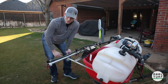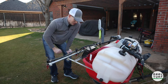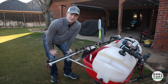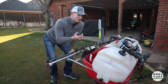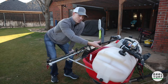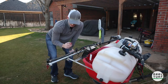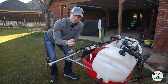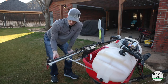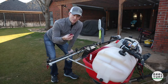These hoses are about two years old, so it's time to probably just change it all. We're going to cut all this loose and replace all these hoses, and I'll give you guys a chance to see how this goes together. I really think that's going to resolve the issue, because I don't have any leaks on this quick connect coupler or anything damaged on my jets. There is a rubber o-ring inside of the jets too, but if those were leaking you would see water spewing out everywhere, so I don't think I have an issue with the jets.